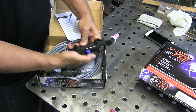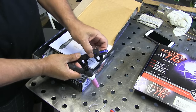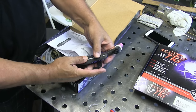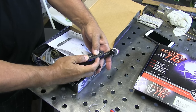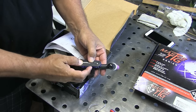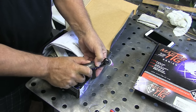Let's take a look at another one. This is a rotary track style, again from CK, with little knobs — you can use your thumb, your finger, or both. It Velcro straps onto your torch body however you want, and you can rotate it around to run it with your finger or thumb or both. You might have to move it for different applications. It's going to take a little getting used to, but it's pretty smooth. Nothing beats a foot pedal though.